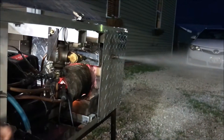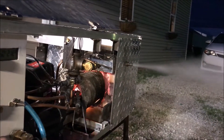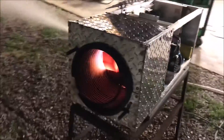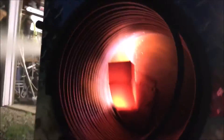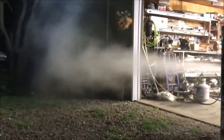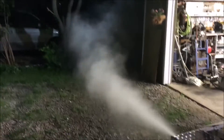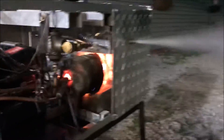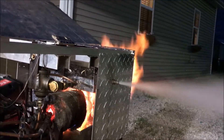I did a quick shutdown there to see how easily it lit back up — it fires right back up. Running this small super hot flame, I'm definitely digging it. That's going to self-clean as well, putting out a beautiful blast of steam. I suggest that anyone who goes to use one of these things store rainwater to ensure you reduce maintenance as much as possible. We're going to have to pump CLR through this thing on occasion to flush all the lime out of the machine.